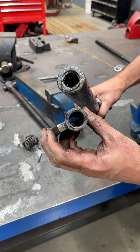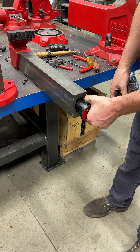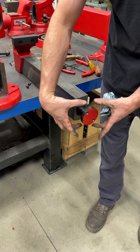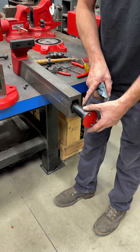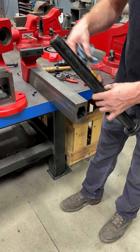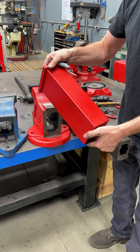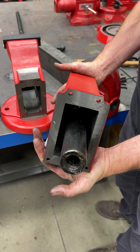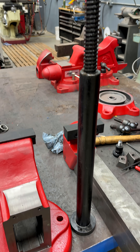The threads are at the very end of this long tube on the hardtail vise. This is what allows us to have a rectangular slide — we're able to hold the nut from the end, and this is what gives us this fully boxed dynamic jaw. What holds this tube nut in is what we call the hardtail. This protects the slide from getting debris in it and it allows for perfect alignment with the screw. Pulling from the back of the vise, the centerline of this screw will always remain straight.